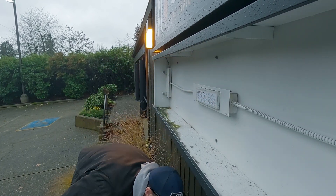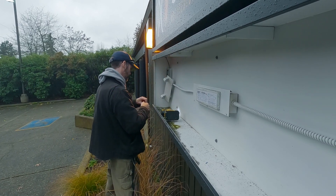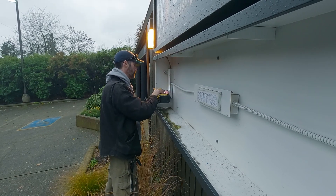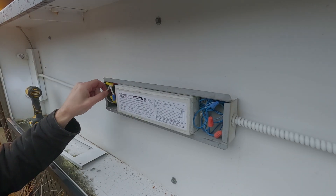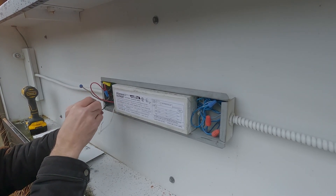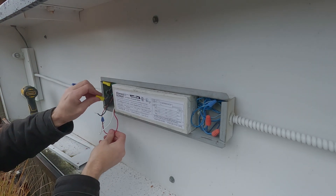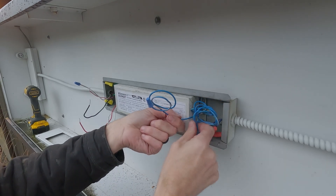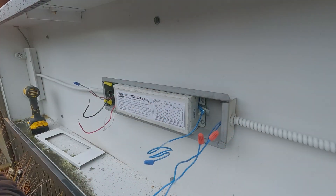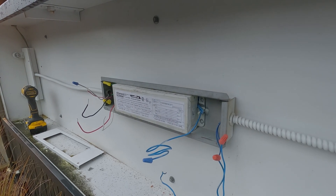Get these out of the way. Yeah, let's test this. Okay, that's off. So this side has the red wire going to it. You just disconnect the old wiring so you can remove the ballast — or you can just leave it there. I like to just leave it there and write on it with a Sharpie that it's been bypassed. As soon as you open this up you realize it doesn't have fluorescent lamps in it anymore, so it's kind of obvious it's been retrofitted. Okay, I've got blues on this side — you can cut all this out, you don't need it anymore. Cut it real short to the ballast though, because I need to extend these wires over here, which I think will just make it far enough.